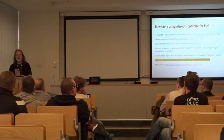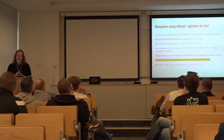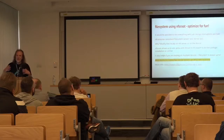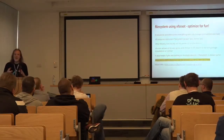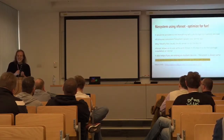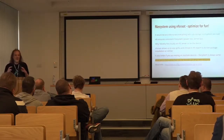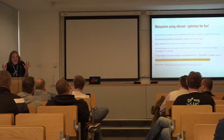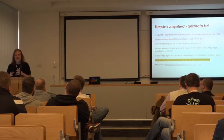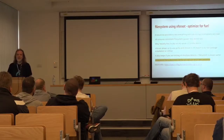Another interesting thing I learned is marked in yellow: the kernel configuration. You tell U-Boot to use DHCP, acquire an IP address, and then load the kernel and initramfs from the server. Once you start the kernel, it also has the option to acquire an address over DHCP — but unfortunately that didn't work. I suspect it's a problem with initialization of the USB interface in the kernel. You can always hard-code the IP address, and that worked. If you want more info about making U-Boot work with NFS root and configuring dnsmasq, the last link on the slide is a wiki page with more information.